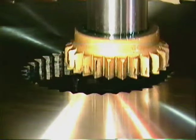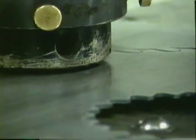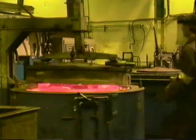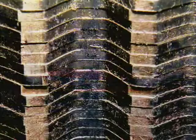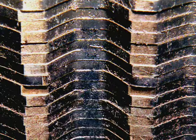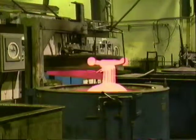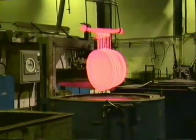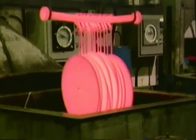Saw blades with machined eyes provide maximum consistent performance from all blades in the gang. When a saw blade is manufactured today, it is laser cut to finish size and then heat treated to the required hardness. The heat treating process causes the saw eye to distort into an oval shape due to grain orientation in the steel. This results in poor contact between mating teeth of the arbor and saw eye, and increased clearance is required to assure that they'll fit together. With a gear cut eye, the distortion is eliminated and the backlash clearance can be minimized and controlled for optimum performance in a variety of sawing applications.